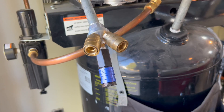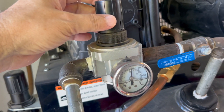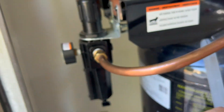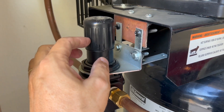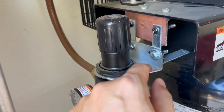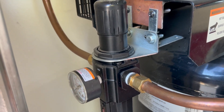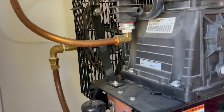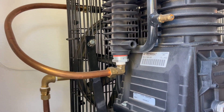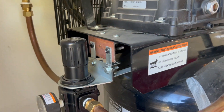Make this upgrade to your air compressor today — your shop will thank you for it. I have a simple ball valve here with a gauge and a regulator, and then I've got a high-flow port and two regular ports. Some people complain about this but it's wide open — it's just there because it's easier to mount. All the air is allowed to freely pass through. I've had no issues with the fittings — 10 to 15 hours a week, a lot of use over the last two and a half years, and I've had no trouble, no leaks, no problems.